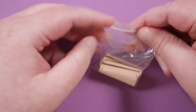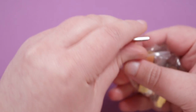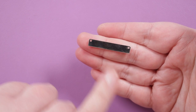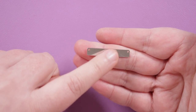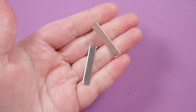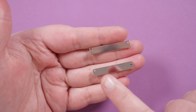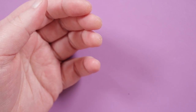I also bought some rectangle blanks that came in silver, gold, and copper colors — long rectangles with holes on either corner so you can attach a chain for a delicate personalized necklace. These are meant for stamping, but I thought they might work for the laser. Unfortunately this didn't work out — and that's my fault. The round blanks are stainless steel, which the laser can engrave, but these rectangle ones turned out to be brass. The laser isn't really capable of engraving brass, so these unfortunately didn't work out.